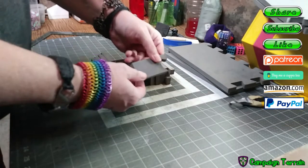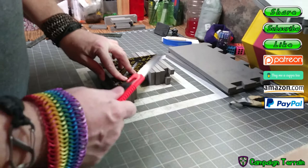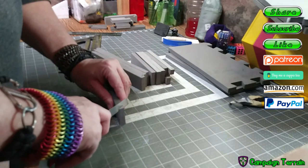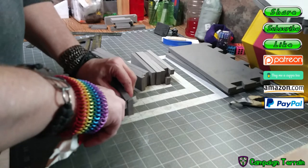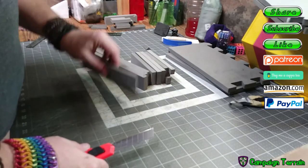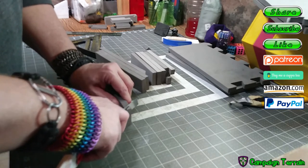I've decided to keep the textured portion on the inside so that I have a smooth surface on the outside. Here I am scoring all four of these along the speed square at 45 degrees so that they're tapered with the texture on the inside. I'm just marking each of the four ends, and then I'm going to take an individual one and cut it the rest of the way through. I want to keep a 45-degree cut tapered inward, making sure my texture is on the right side.